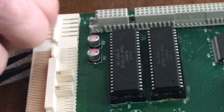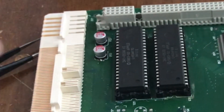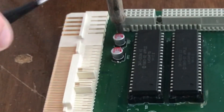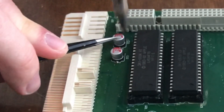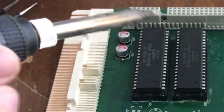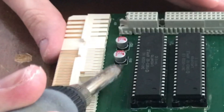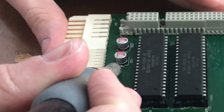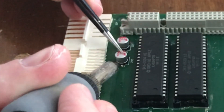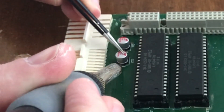Be mindful of nearby plastic components to your soldering iron. I accidentally melted a small portion of the PDS socket off — it's not going to impact operation, it's just cosmetic, but just be mindful that the iron is indeed very hot and can damage nearby components. The reason I tapped on the new capacitors is to make sure that they are securely fastened to the board and that the soldering joints are solid. I had some doubts so I just physically confirmed it. Don't push too hard — just lightly tap on it. If it's loose, it's going to wiggle; if it's solid, it's not going to budge.